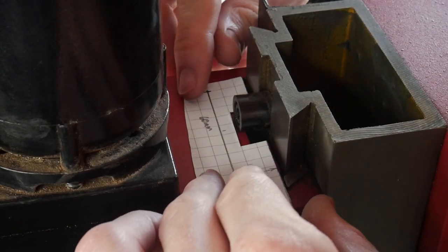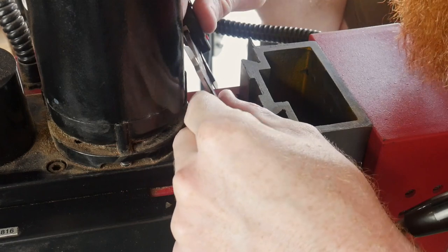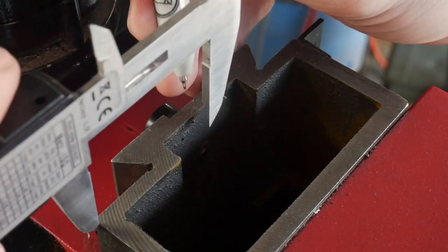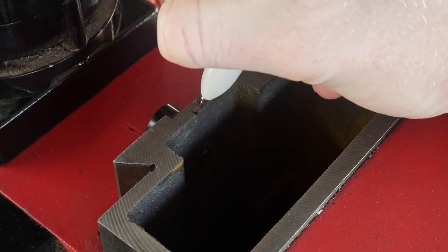It's worth mentioning at this point that I think that 18 millimeter dimension could be slightly larger because my air spring system seems to not be perfectly square in the final assembly. So if you're going to be doing this, I would think about bringing that up maybe to a 20 millimeter dimension and you'd be slightly more square with your final product.